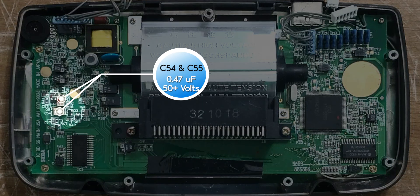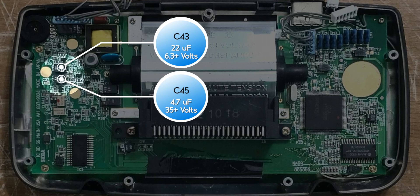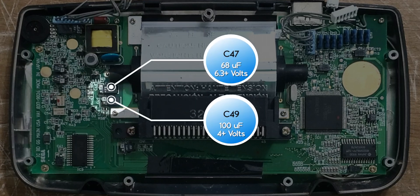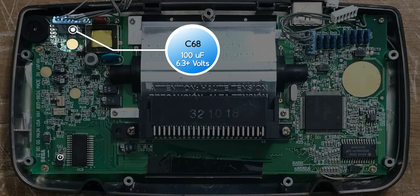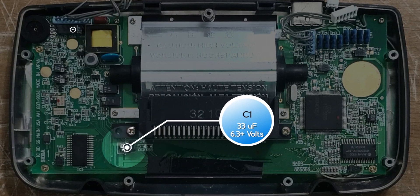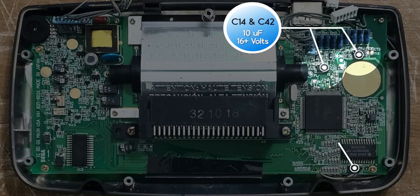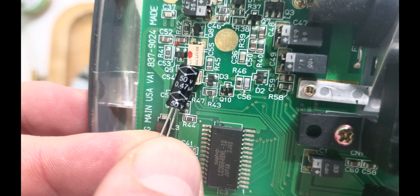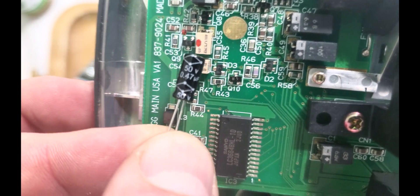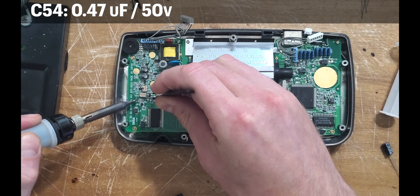For this repair, we will start with capacitors C54 and C55. Next up, capacitors C43 at 22 microfarads and C45 at 4.7. After that, we have C47 at 68 microfarads and C49 at 100. Down at the bottom left of the board we have C4 at 10 microfarads, and C68 in the top left at 100 microfarads. Under the far left of the cartridge connector is C1, rated at 33 microfarads. And finalizing our main board, we have C14 and C42. Go ahead and pause the video for the capacitor list. The capacitor's voltage is a minimum working voltage, so feel free to use a higher rated one. Just don't use a capacitor below the working voltage, and make sure the microfarads are exact.